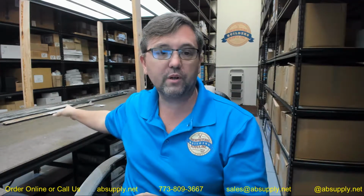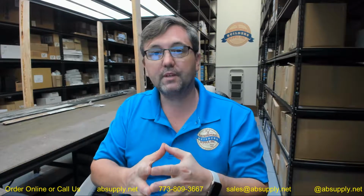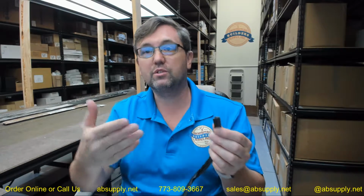We've got proper gasketing, and in fact, this client, the front door of the country club, that's all their gasketing. Their sweeps, their threshold, their perimeter gasketing. But here in southern Florida, you can just put your hand on the outside of the door and feel the cold air leak out. So I've advised the client to run this up along his rabbet and his stop face. He's got a double door, so it's going to be the stop face on the two hinge jambs, and then it's going to be the face of the stop on his header. And that's going to really help, giving you an additional line of defense.